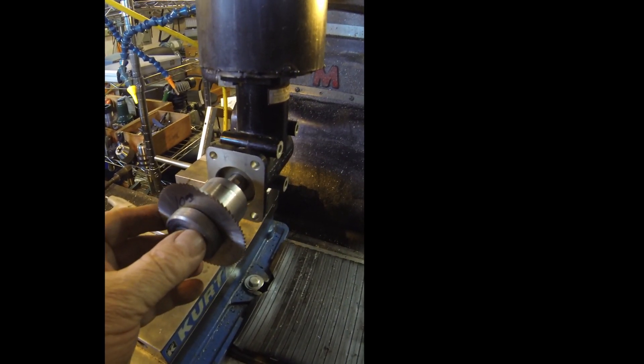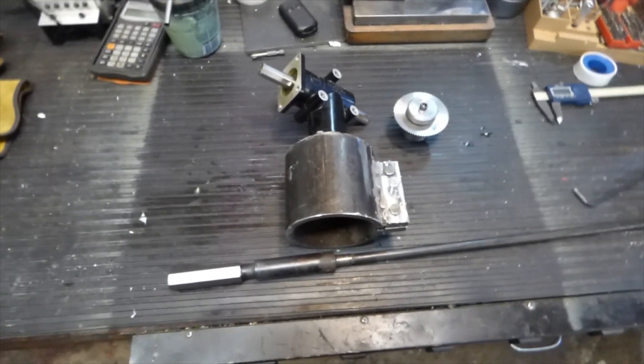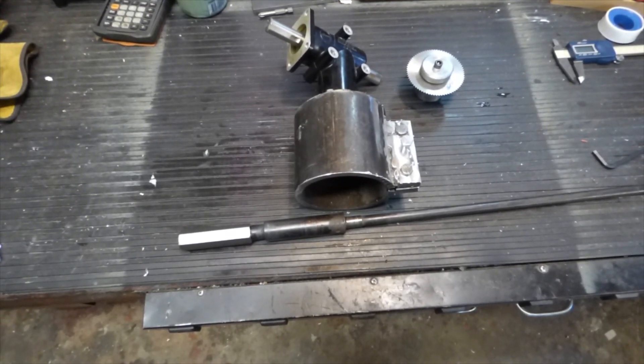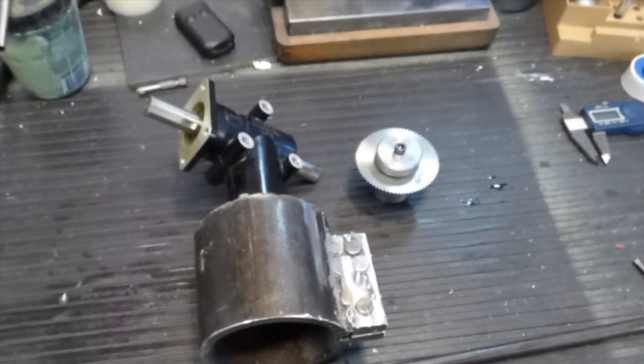This is a saw arbor that I built to fit on here, and it's not quite ready for prime time yet. I need a piece of 3/16-inch key stock to finish it, then put a set screw in the side — I haven't been to the hardware store to pick that up yet. Here's all the pieces for the right angle adapter: you can see the draw bar with the extension, the quill sleeve, the right angle adapter, and the slitting saw adapter.